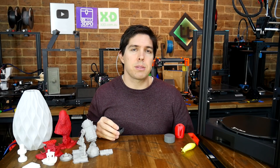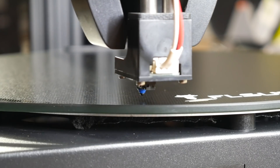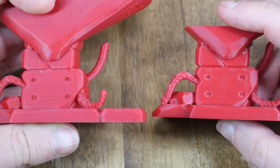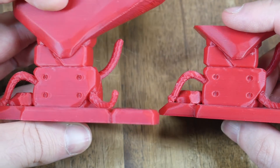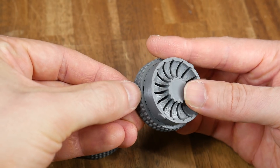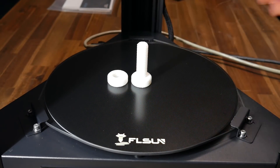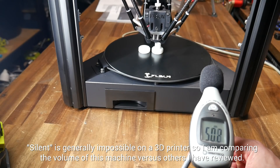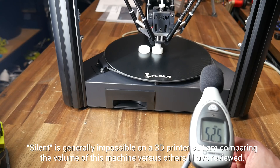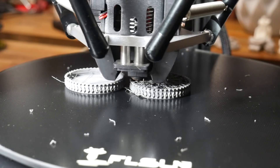Let's summarise the strengths and weaknesses of this machine. I would describe my experience as pretty straightforward, starting from the assembly and the auto bed levelling process, which proved to be quite effective. The print quality is quite acceptable even on the fast preset, and if you wanted to eliminate the ringing, using the quality preset will achieve that with still quite reasonable print times. The built-in slicer profiles are quite reasonable but are mainly optimised for PLA — you would need to tune them a little more for other filaments, to eliminate gaps in the extrusion and excessive stringing for TPU. The glass bed did a good job gripping filaments when hot and then self-releasing the parts once cooled. In terms of the manufacturer's claim that the printer is silent, I'd say that's fairly accurate — mid-print I recorded just over 50 decibels, spiking higher for louder retraction moves. However, when the printer is moving at its fastest, it does sometimes have a nasty rattle.